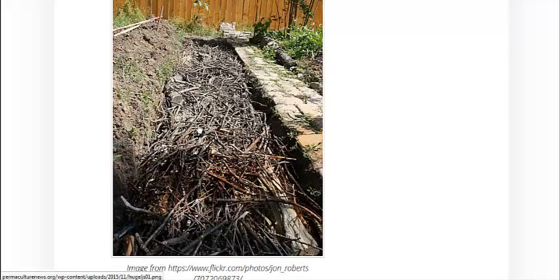But if you use it as a swale, wood floats. Let's say you have an acre of land with one large swale on a hillside at the bottom of the hill. If you get an inch of rain, that's 24,000 gallons of water. It hits this swale and hits the mound that's made partially with wood — those logs, that wood's going to start floating. It could start picking up a section of that swale, move it out of the way, and then you've got a landslide. Maybe not a very fast-moving landslide, but as this article points out, you don't need a lot of speed if you've got a lot of mass — and 24,000 gallons of water is a lot of mass.